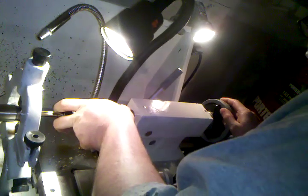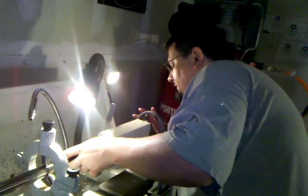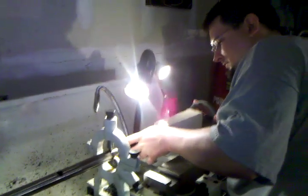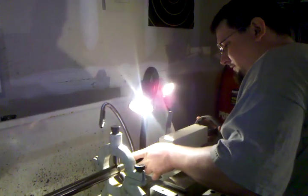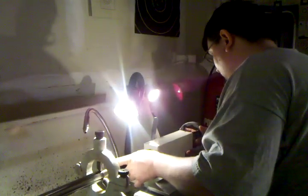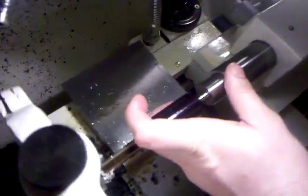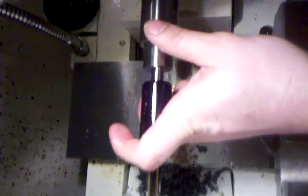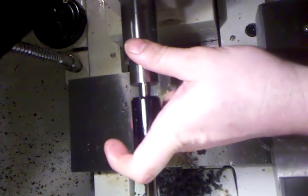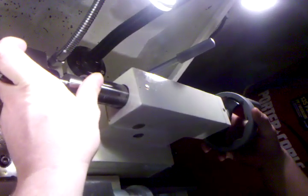Back it off 10 thousandths. Engage the machine. Cut — taking 50 thousandths at a time. You have to be careful not to jerk it if you're holding the reamer holder, or it will jerk it out of your hand. Nice and steady.